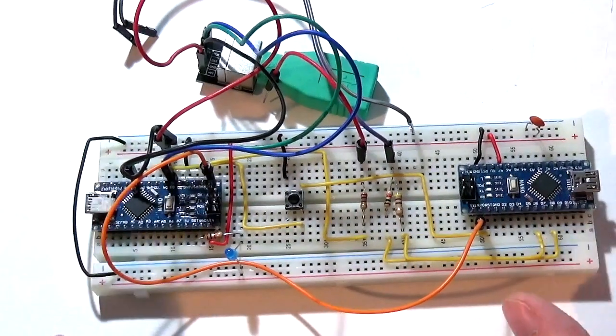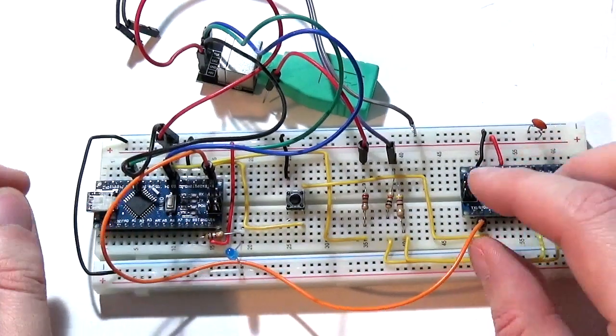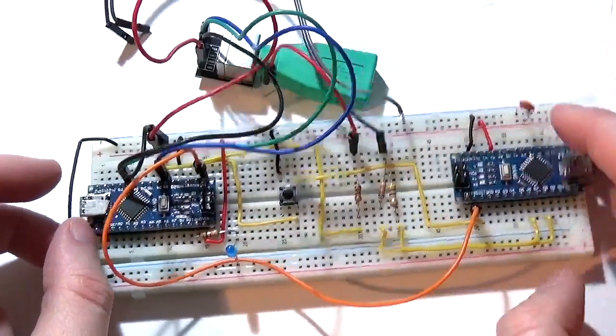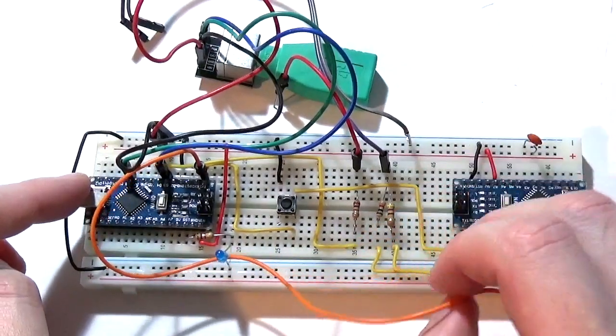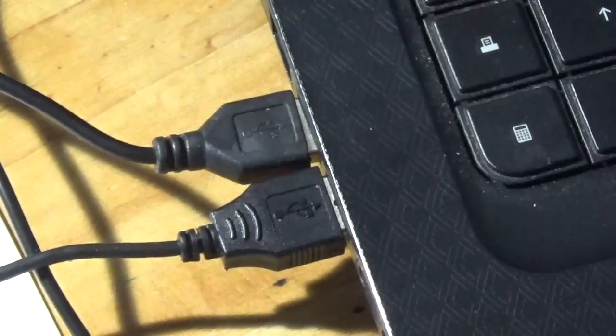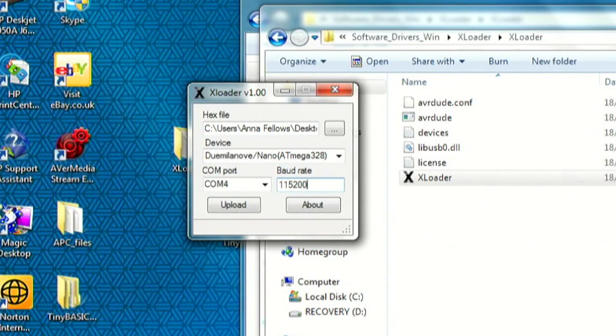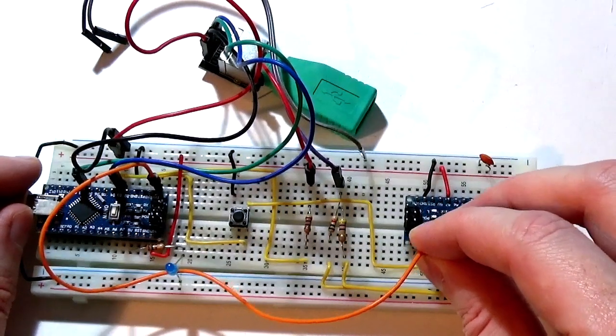We'll start with the main Basic interpreter and kernel ROM update. We flash hex ROMs straight to our Arduino Nano chips. If you're going to update or reflash the ROM - and we showed you how using the X Loader software on Windows - you need to disconnect the serial lead. We left this lead as a jumper wire so we can disconnect one side from the terminal. Once disconnected, plug the other side into your PC and use X Loader on Windows to reflash the new ROM kernel, then reconnect to the RX pin on our second Arduino.